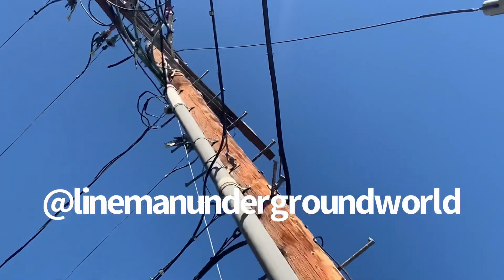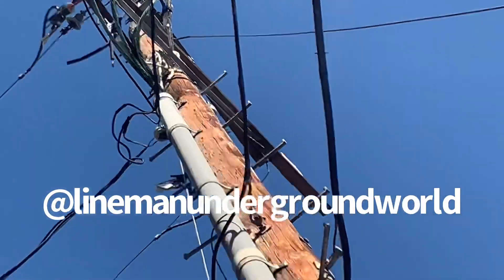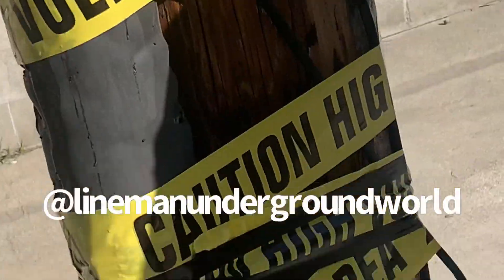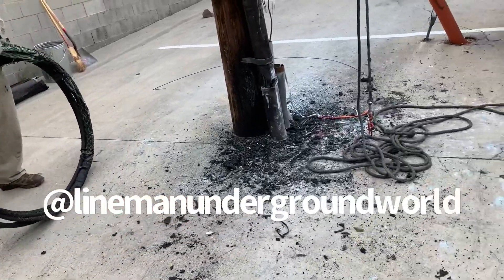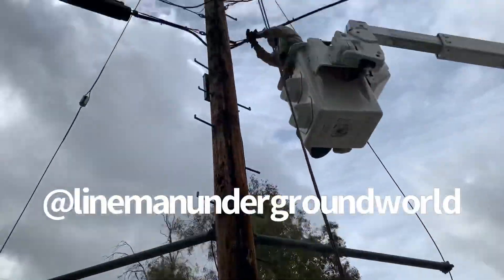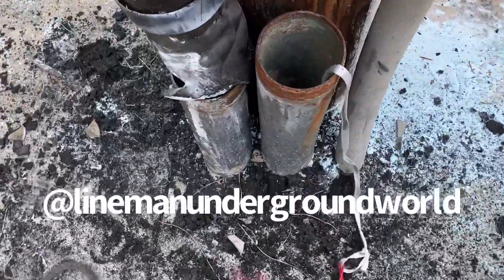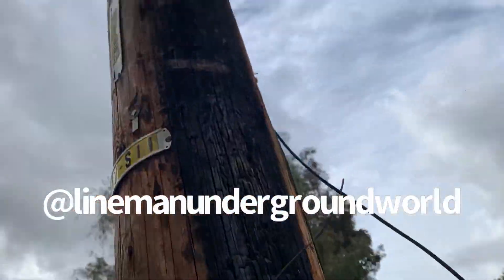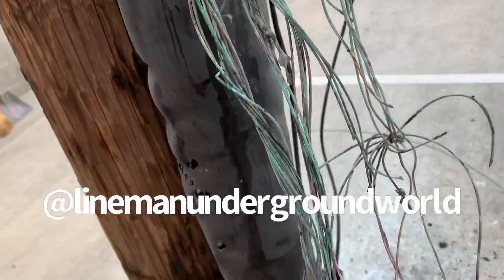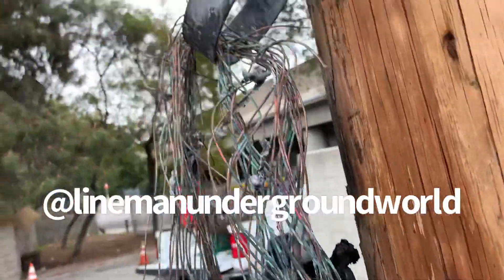The temp cable's up there. The other one's been cutting it clear, as you can see right here. We're here to finish the job off. We already took the cable out and took the old riser down. We're going to rebuild it anyway. As you can see, this was all burnt up. We're going to use the spare because last time on that other one it was really bad — we had to swab it a lot. This is like our fourth one in a couple weeks. These guys think it's low voltage, but this is 4,800 volts between the phases.